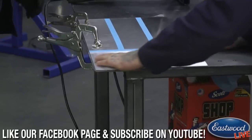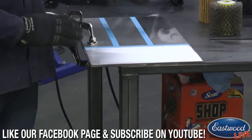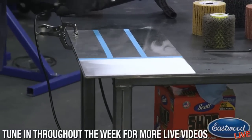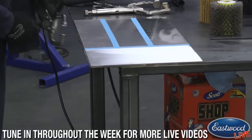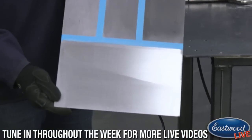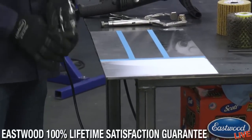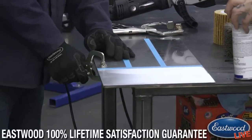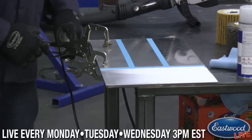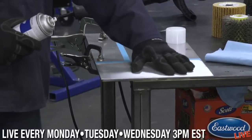Wow, that's pretty good — that's all you needed. So if you're going to make a dash and you don't want just that unfinished look, you want those nice light streaks across looking like something that came out of a production facility — that was all of five or six seconds. What we're going to do right now is take some low VOC pre, spray this down to get the contaminants out of the actual aluminum itself, because when you're using that drum it is pulling some of that material and grinding a little bit in.